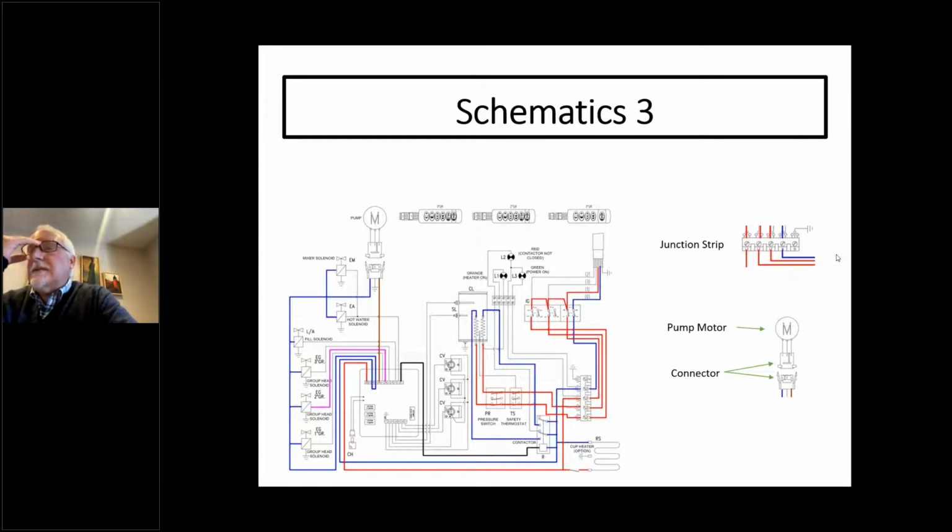I installed a machine once, 30 years ago. We were leaking a little bit of voltage to ground. We weren't sure where it was coming from, and I was relatively new in the business. The machine worked fine. Everything was great. It's just that when somebody would run water in the sink, about 9 feet from the machine, they would get shocked every time they put their hand under the water. We traced it back to the machine because it was leaking voltage to ground, but not enough to trip a breaker, just enough to make things interesting. So yeah, don't switch those. It will perform a lot of the same functions, and it will in fact work, but it would be bad.